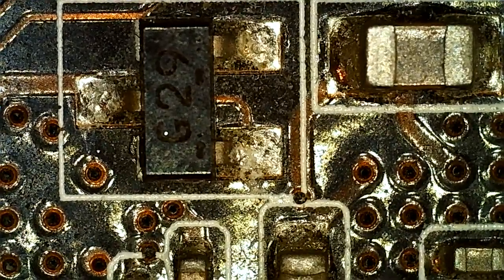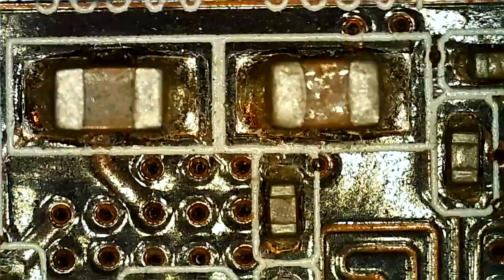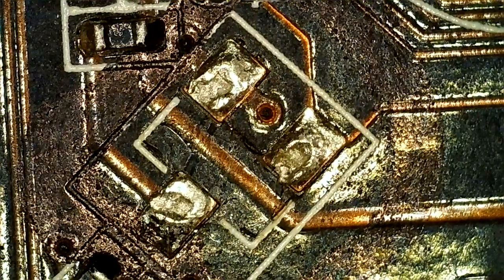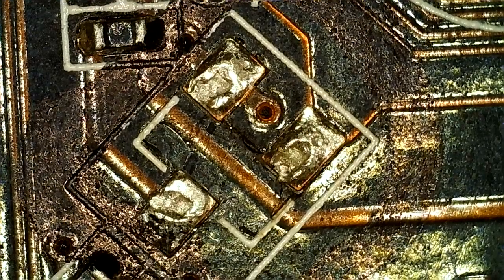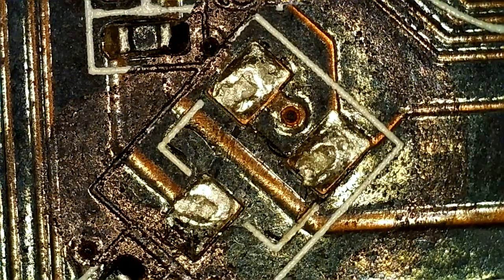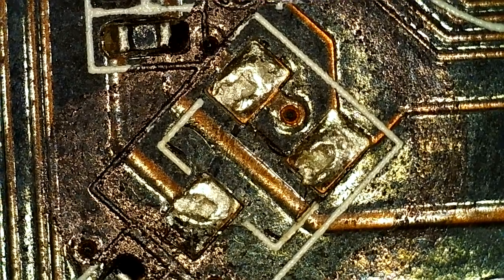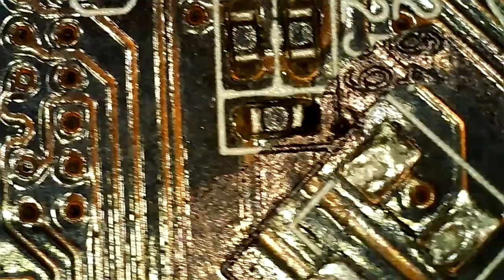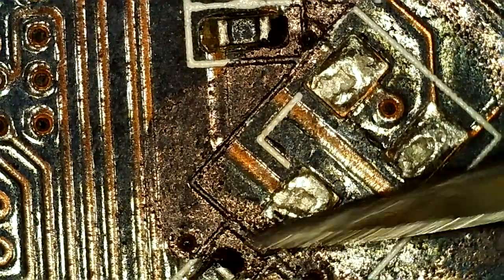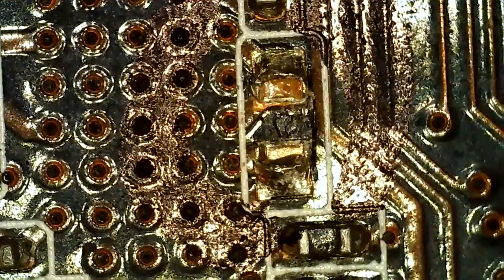and it seems like every memory chip, or every pair, has one. So for every two chips, there seems to be one. I did notice by looking at the image on the internet too that this one should be the same. And there are memory chips on either side of this one too, so it makes sense that it is part of that. And what you can deduce by looking at the traces, it seems to make sense, because this pad here always goes to a resistor with a bunch of other resistors that goes over to the memory ICs area.